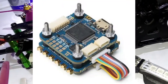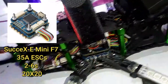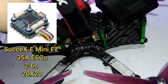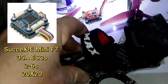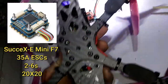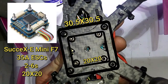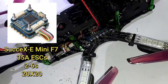These go straight to the stack. The stack is up in the top corner — I think it's made more for a tiny whoop but you have to put a 20x20 in here. You don't have to, you can fit a bigger one, but because of this Johnny FPV frame a 30x30 sticks way out and when you look down you can see the sides of the board sticking out, leaving a lot unprotected. So you want a 20x20 board. It connects to the bolts on the bottom — you can use the inside bolts for the 20x20 or the outside bolts for the 30x30.